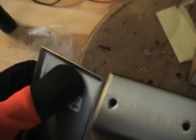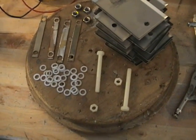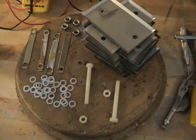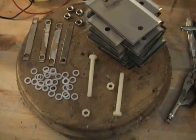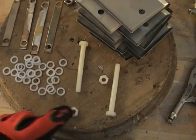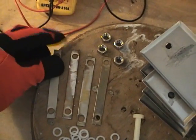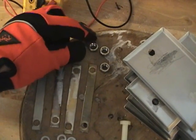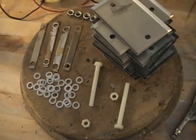I drilled the 5/16 holes in these. I'm going to grind off the back a little bit where it's rough so that the washers will space evenly. We've got everything here to start building the cell — we're going to attempt to build a 15-plate cell: three positives, three negatives, and a bunch of neutrals. We've got 5/16ths bolts, nuts, and 5/16ths by half-inch washers — these are where our power connections will connect to the cell — and some 3/8ths nuts that will act as spacers.